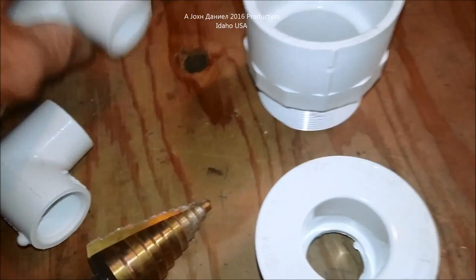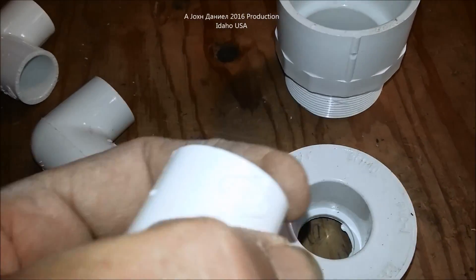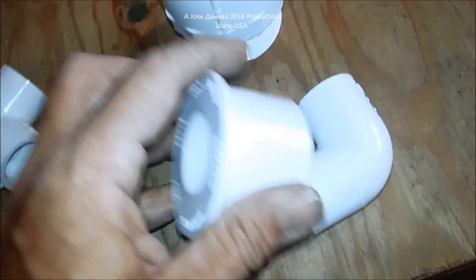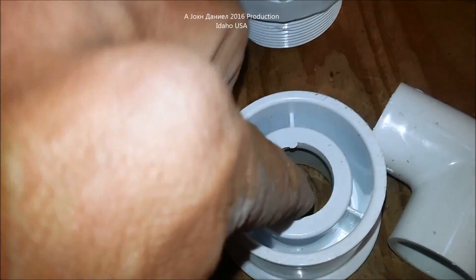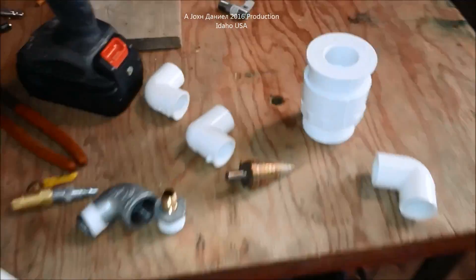This is a threaded one and this one fits very snug into that. You're going to have a clean side and a side with some lettering on it — if needed you can grind that off — but PVC glue will glue right in perfectly and hold very tight. Once this has been drilled out so the pipe slides through, the pipe will go in and glue into that socket down inside this fitting. This fitting screws into the top.